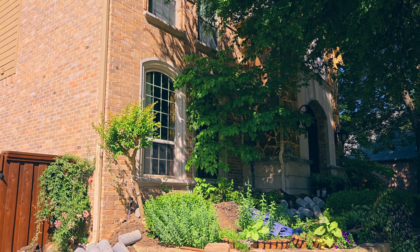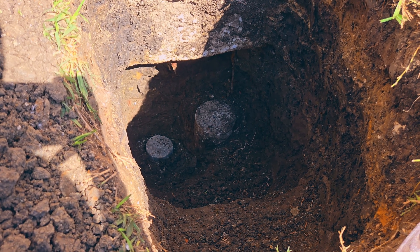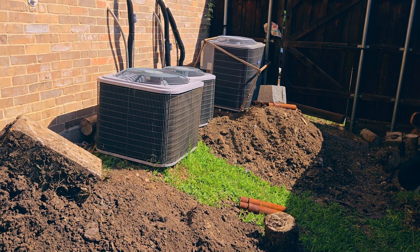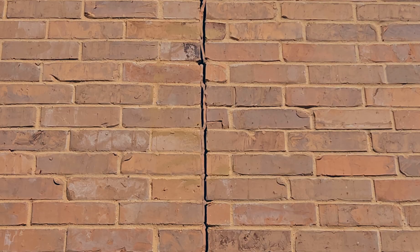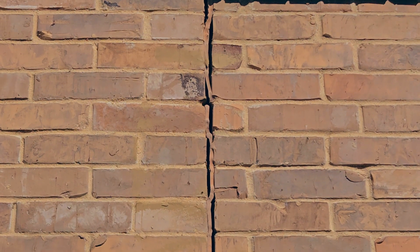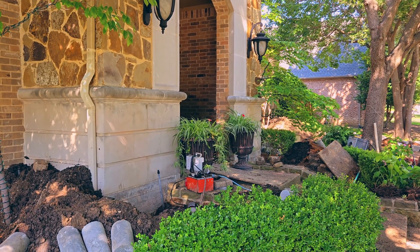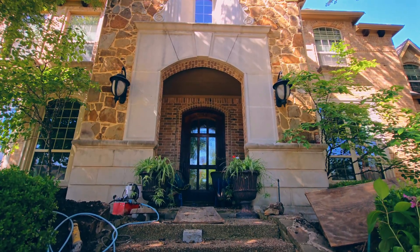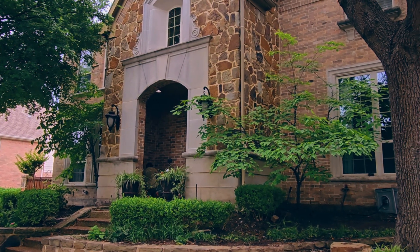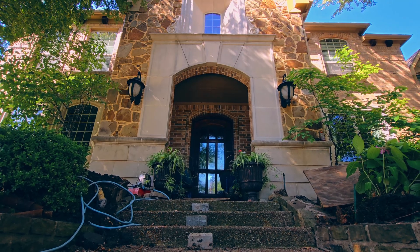This is a big house with a huge foundation. On the right we have the old concrete piers and on the left we have our hybrid pier. We have about six piers installed out of 32. There you can see the expansion joint that is wide open. The foundation is about two inches low. The exterior grade beams of the foundation are approximately three feet deep.